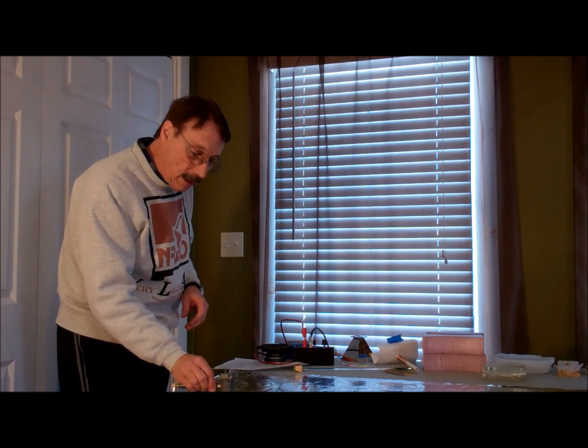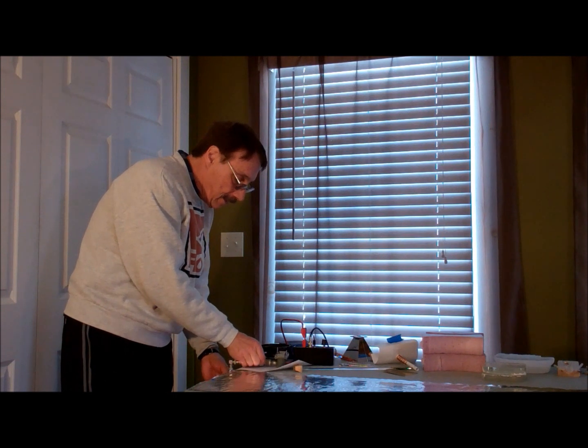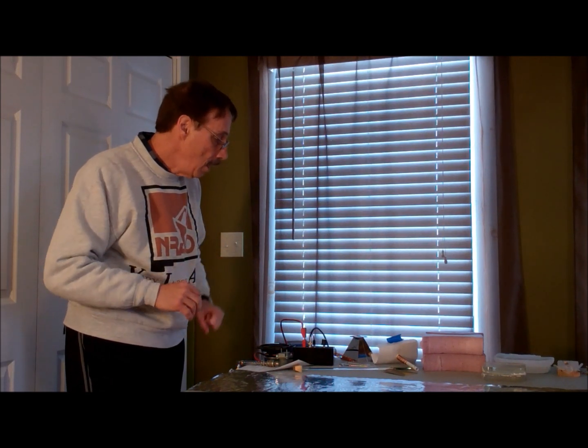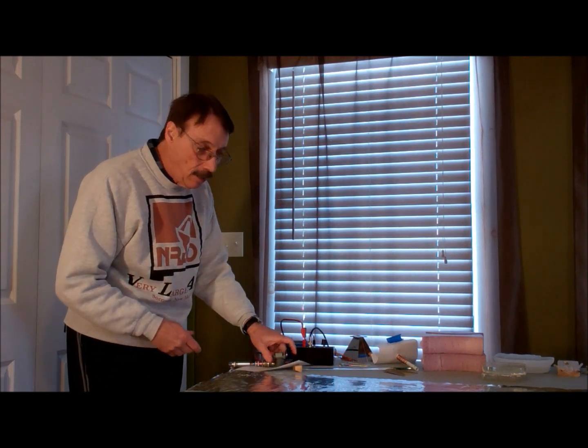What we can do is try to make this circularly polarized. I've made some devices to hook to these. They're not well matched — there's some impedance mismatch. They're things I wound so they're not perfect, but it'll give you a rough idea of how you could possibly smooth out that really rough signal so you don't have to move your antenna as much.